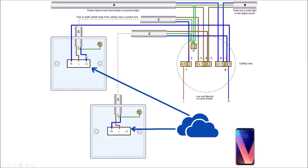The L1 cable provides the mechanism for turning the light on. The way it works on Wi-Fi switches is via scenes — scenes are something you set up that provide logic between devices. What we're going to do is take one switch, create a scene where if its button is pressed the other switch activates at the same time, and vice versa. The only thing to be aware of when using this method is it relies on internet connectivity — it goes out onto the internet via cloud connectivity to trigger the other switch. So if your internet goes down and you press the button, nothing will happen.